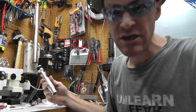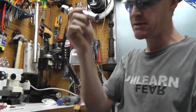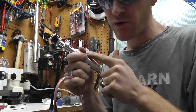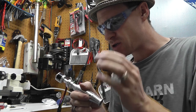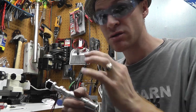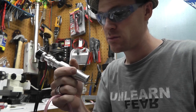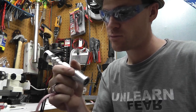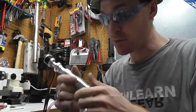So the big question — how does it work? Well, it's really not too bad. I added two set screws in the back coupling, one on each side. On the front coupling I only added one even though I made two holes — if I add the second set screw it gets a little off balance. What I could do is drill extra holes in the side and add set screws to balance this thing out. But as it is it's pretty good. Adding that extra shim from the other video actually made a huge improvement and I'm very glad I did that.